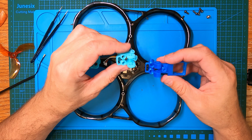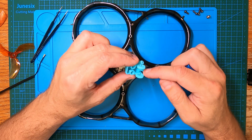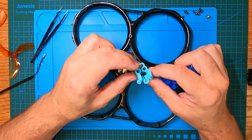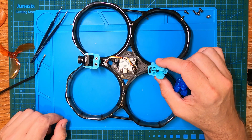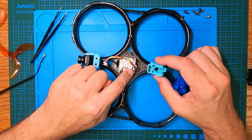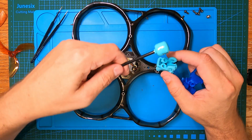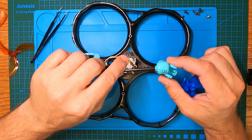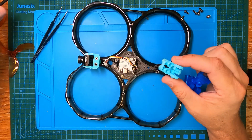These TPU designs are really great — there's a little cut at the front so you can slide your antenna in and out quite easily. You still need to disconnect it from the UFL on your Vista, as you won't be able to get the head through without potentially damaging it, so you disconnect from there and then slide it back into the new mount.